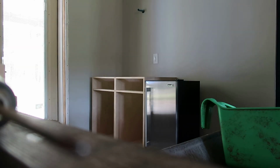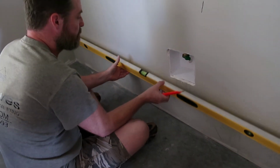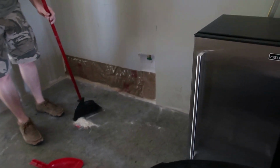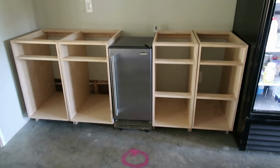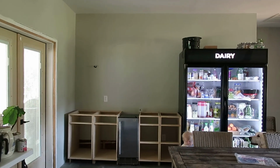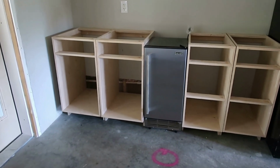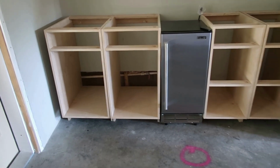So there wasn't a drain pipe for this ice maker. We had the inlet where we get the water from, but there's no drain. So we did, in fact, cut out the wall to put in a drain. Jay was talking about putting them inside the cabinets, putting a piece of PVC, but I was like, no, let's just cut open into the wall, because I can put that back. I know how to put the drywall back. So we went ahead and ran PVC out, and so this will have a really nice drain. We don't have to have it inside the cabinets. I'll close off that wall and fix the drywall at a later date. We actually did end up closing it off, so you'll see in the next clip it's closed up now.